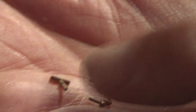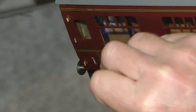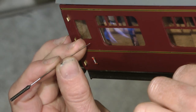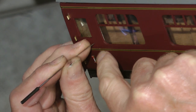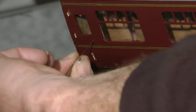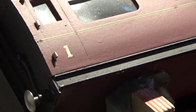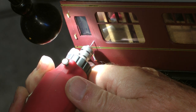Ready to put some of the final detailing on — these are the grab handles and door handles. Looking at various pictures of LMS coaches, the door handles go just about level with the window cut-out, and they're actually in the centre almost between the carriage stripe and the bottom of the door window. So what I'm going to do is just use my broach to make a little starting hole for the drill to catch on, then get my little portable drill with a very fine drill bit and just drill that hole through.